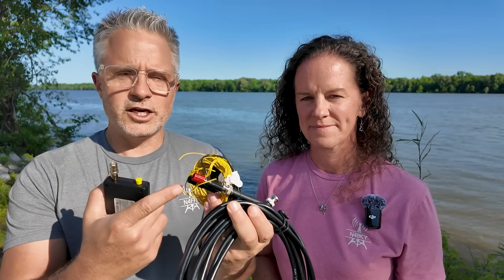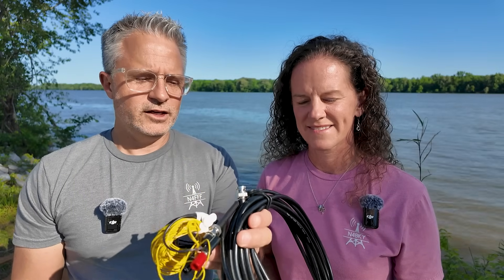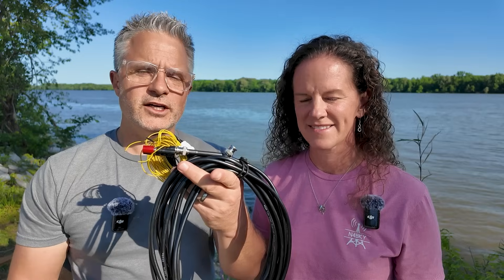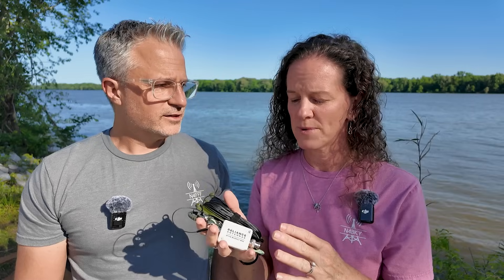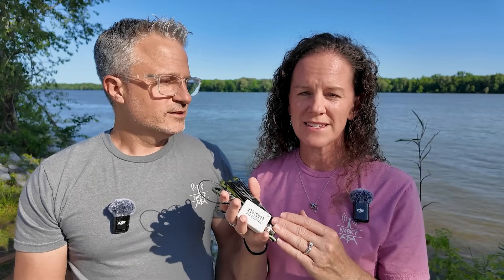So driving it all home — what would we tell somebody just getting into radio? In photography they say the best camera is the one you have with you, and I'd say the same thing for antennas. As long as you find an antenna that suits you and you use it, that's the best option. If I was starting over from scratch, I think I would start exactly how I actually did: for just a couple of bucks, you can get an adapter and some wire, cut your own antenna, and get a coax cable like this 25-foot one. Works great at the beach on a pole, works great in the forest on a tree branch. After you get a little more experience, then maybe go to the end-fed half wave, possibly using the antenna analyzer to help cut and tune it. If we had to pick one band and you're a General or above, go with 20 meters. If you're a Technician, 40 meters or 10.